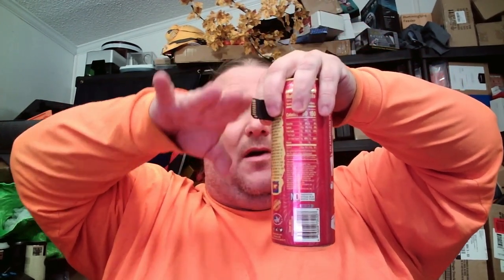So how can you print that without printing all this support to hold up all these fins — there are like 30 of them all the way around? Break the model in two. You might not have access to the ability to break the model in two, but you can do it in the slicer in limited situations. In my particular use case, I figured out the distance from the bed to the bottom of the fins is 68 millimeters. So I simply tell the slicer to only print the first 68 millimeters. The print bed in your slicer is virtual — if I do a Z offset of negative 68, I'm pushing the model through the print bed so only that part is exposed above the print surface, and that's all it's going to print.